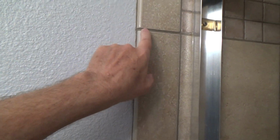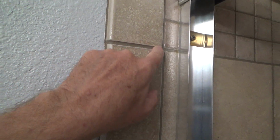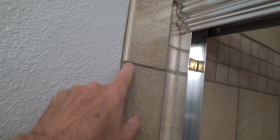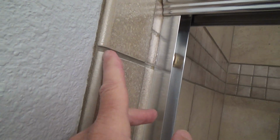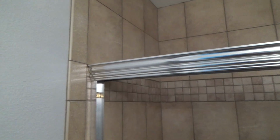And they think, that's good enough. Well, when you put the sealer on, you'll notice that your grout's gonna change color. This is the actual color of the grout when it's wet, okay? And so if I would have stopped this sealer right here, this whole grout line would have been a light color. I didn't want that, so I actually had to cut this in too. And when I cut it in, see how nice that looks? Doesn't that look professional? Here it is, an average Joe doing this on my own, saving the money from paying a painter to do all this.